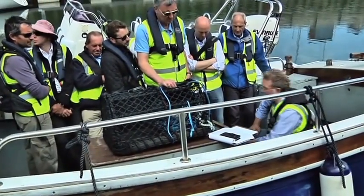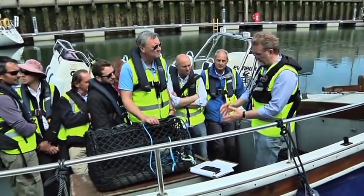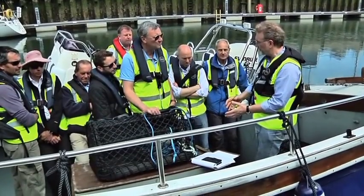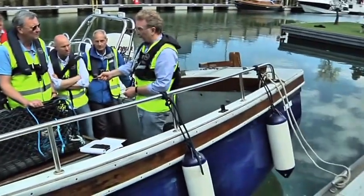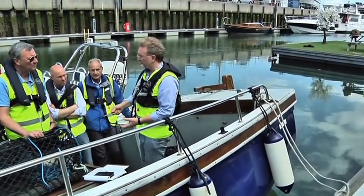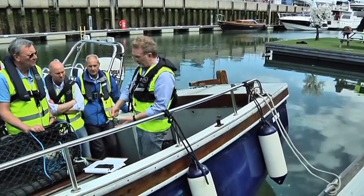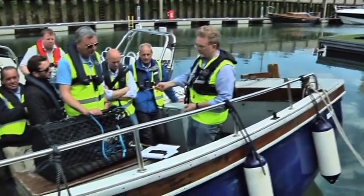So even at 14 degrees, we're not allowed to have the boat like this because it can't go to 14 degrees, but it could go to 10 degrees, and we know because we've got 475 millimeters of freeboard at 14 degrees. Obviously, if we take some people off to get it down to 10 degrees, we're going to still have more than the required 300 on that side.